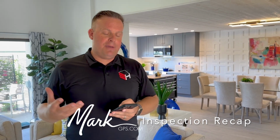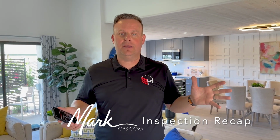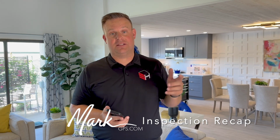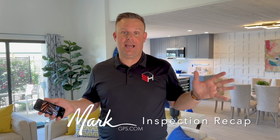You'll see that I make mention of possible asbestos wrapping. And the reason I say that, there's an old vent pipe labeled Johns-Manville Transite. It's very common. I can pretty much tell you 99.9% it probably is asbestos, I just can't test it. It's a vent pipe for the furnace. You're never going to touch it. Don't hit it, don't chew it, you'll be fine. I just always say, if you want to have it removed, you can.